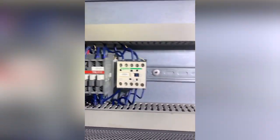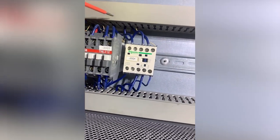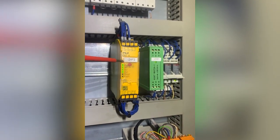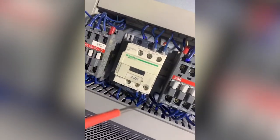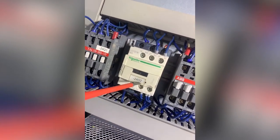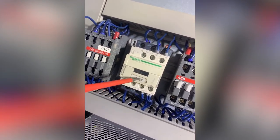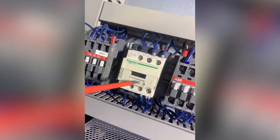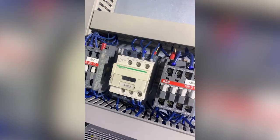And because I'm a proper engineer, I've put the trunking lid back on. I've put the idents back on, so that next time people coming in here can read what it is. I ain't just left them blank and chucked the old ones in the bin. I've swapped them over because they're what makes life easy. And if you just change the contactor, don't put that back, that makes it really hard for the next guy, which could end up being you.